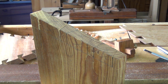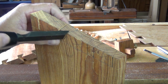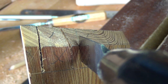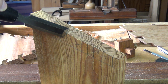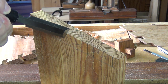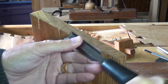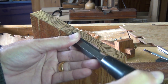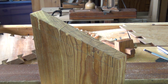So what I do is I'll take a chisel, line it up with where I want to start. Bevel it around so it's in line with the cut — I'm looking down the plane of the chisel. It's in line with both the cut lines on the end and on the front of the board. Give it a little push, then come in from the side and just take that little notch out. That gives me a great starting point for the saw.